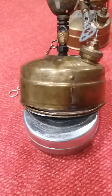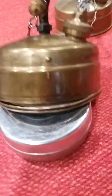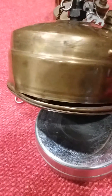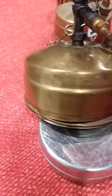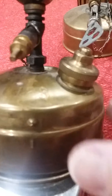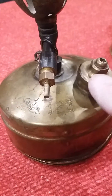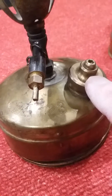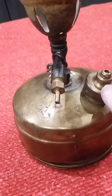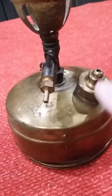Good morning. I've had some questions about the Svea 123 tank that parted and blew open. This is it right here. I've got my other video that just gives a short little show of it. I've had a lot of questions about what happened and how this could have happened, because right here is a cap that's supposed to blow open. Basically if pressure gets too high in this tank, this cap blows open — it essentially turns that stove into a blowtorch. In all honesty, I think what happened with this tank was really a safer alternative than sending out this huge plume of flame.